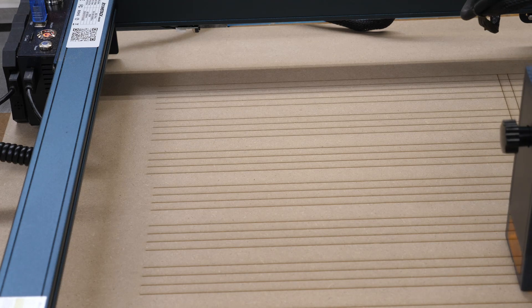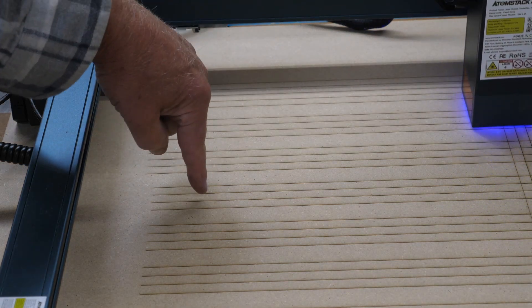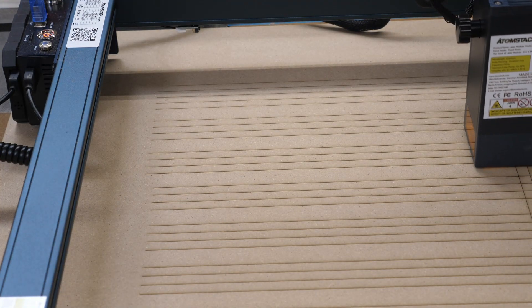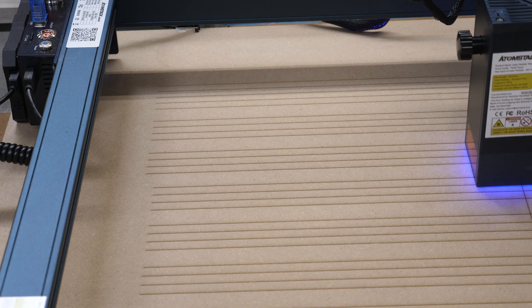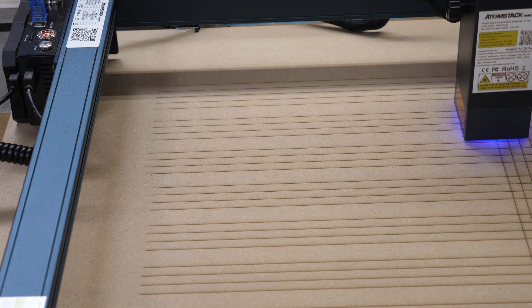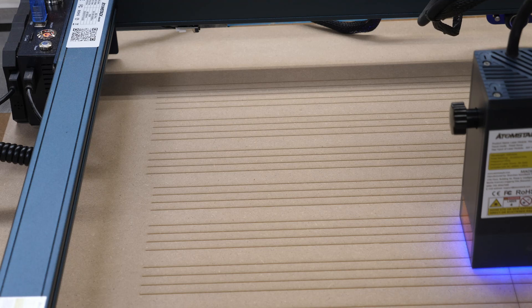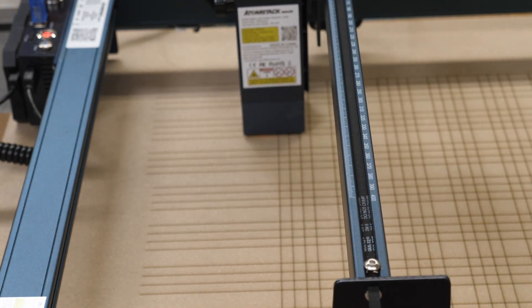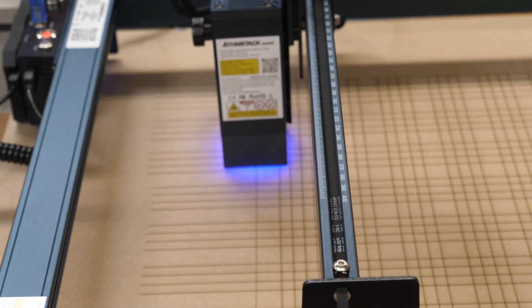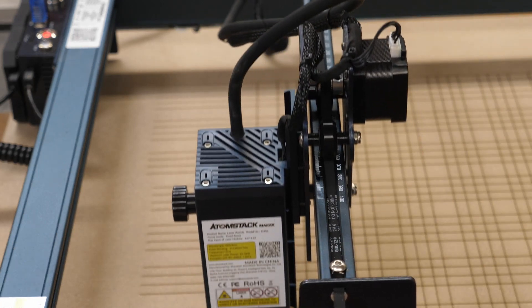Something I'm puzzled about — and it won't affect the use of the grid — but you'll see the lines are 10mm lower here and 10mm higher on the other side, which is not what's on the LightBurn layout, so I don't know what's going on there. I'm doing each line in two passes rather than one to reduce scorching. Even with air assist on, with MDF if you run too high power you'll get scorching by the lines, and I'm trying to avoid that.